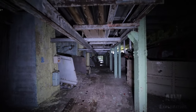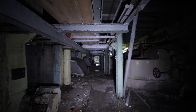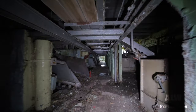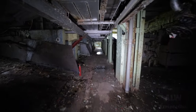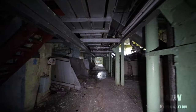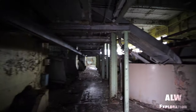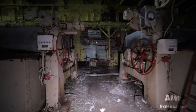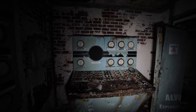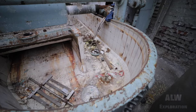The wash material from the potcher is then treated with a saturated solution of chlorine. The digested and barred rolled material is then treated with a little hypochlorite, resulting in a fully bleached pulp material. This process creates a bleach pulp being washed on a rotary vacuum filter. The product is beaten, followed by refining. Both these processes expose new surfaces within the fibres. After dilution, the bleached product is spun tangentially, which removes imperfections.